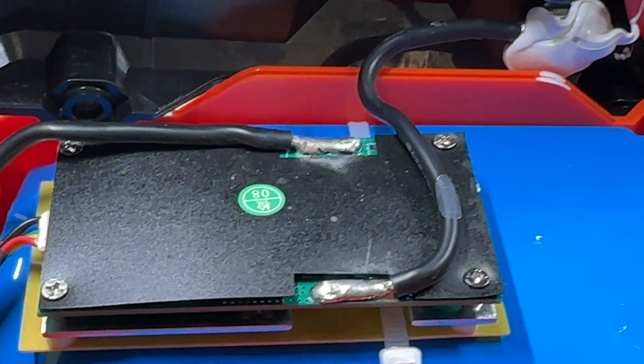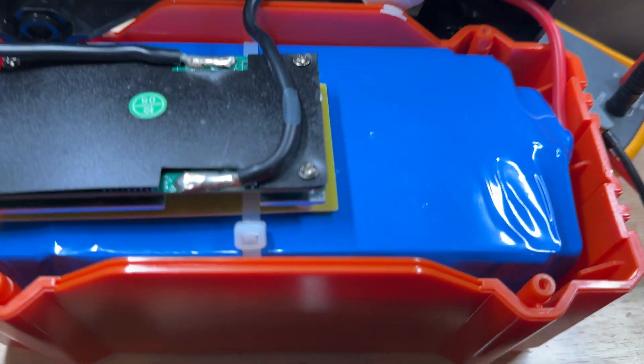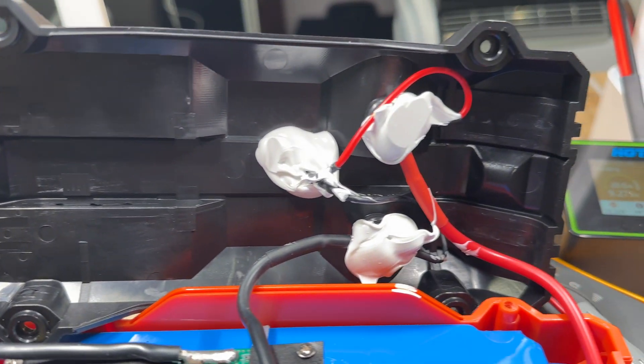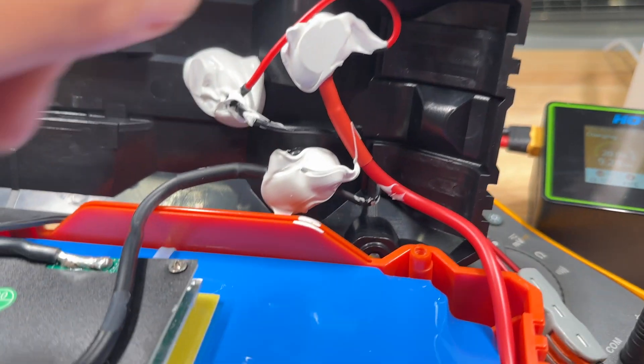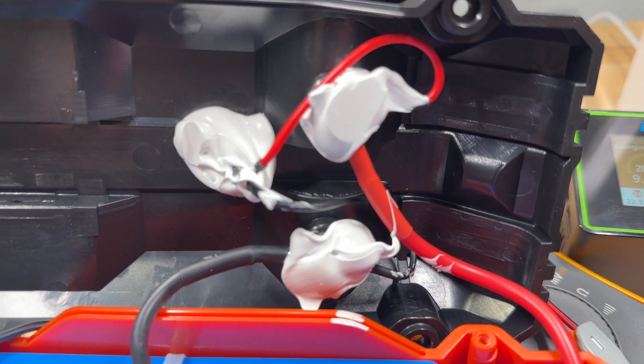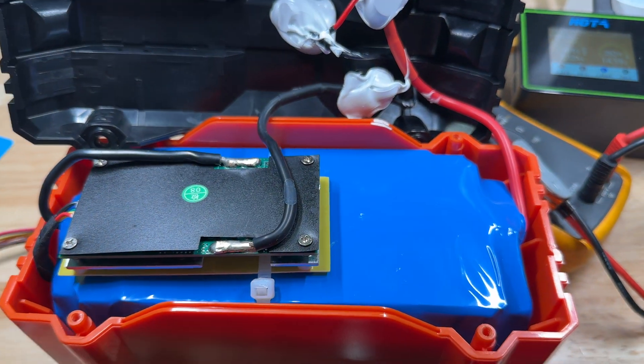In some ways I like the simplicity. There's no display, there's no Bluetooth or Wi-Fi, there's no on-off switch — this thing can just stay on forever with very minimal vampire load. Under the cover there's plenty of real estate. If you wanted to add a second DC barrel jack, an XT90, a switch, or an indicator light, you could probably even fit an Arduino with all the extra space you have under here.